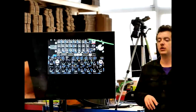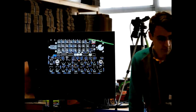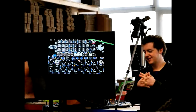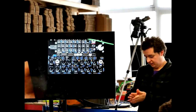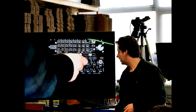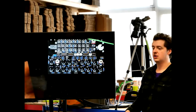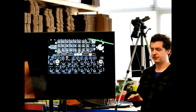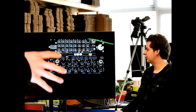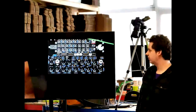The FM channel one is the LFO and channel two is the envelope — it's all on the signal diagrams. The heart of the synth is this basic VCO, VCF, VCA setup. For anyone unfamiliar with the VC naming: that just means voltage controlled. We're in the analog domain — there's no digital control, everything is done with voltage.